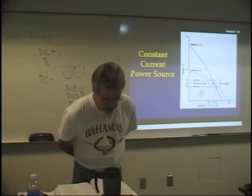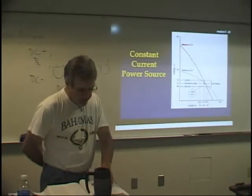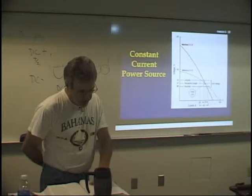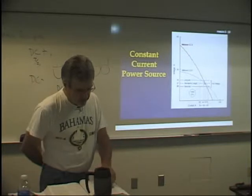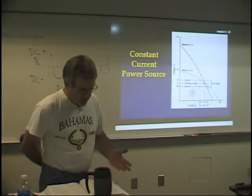Let's see, drop down to where it says, the arc welding process requires enough electric current, which is measured in amperes, to produce melting of the work and the metal electrode and the proper voltage, which is measured in volts, to maintain the arc. Depending on the size and type, electrodes require 17 to 45 volts and approximately 100 to 500 amps. The current can be alternating or direct, but it must be provided through a source that can be controlled to meet the many conditions encountered on the job.